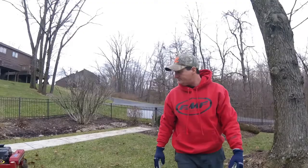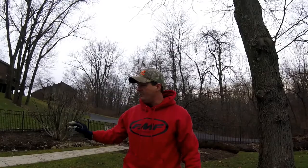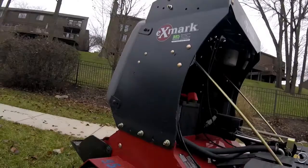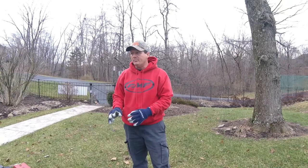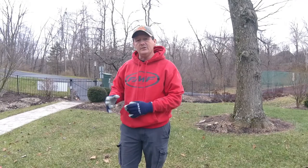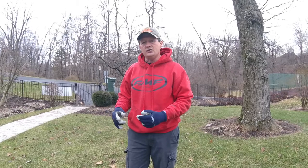One thing I want to mention as you aerate with the unit is the back tires are very narrow. Sorry, that makes it a little quieter. The back tires are narrow. So as you aerate, it's important that you set up the rider control settings properly so your traction is shared between the tines and the tires. Mostly on this unit, the tires do not provide much traction.